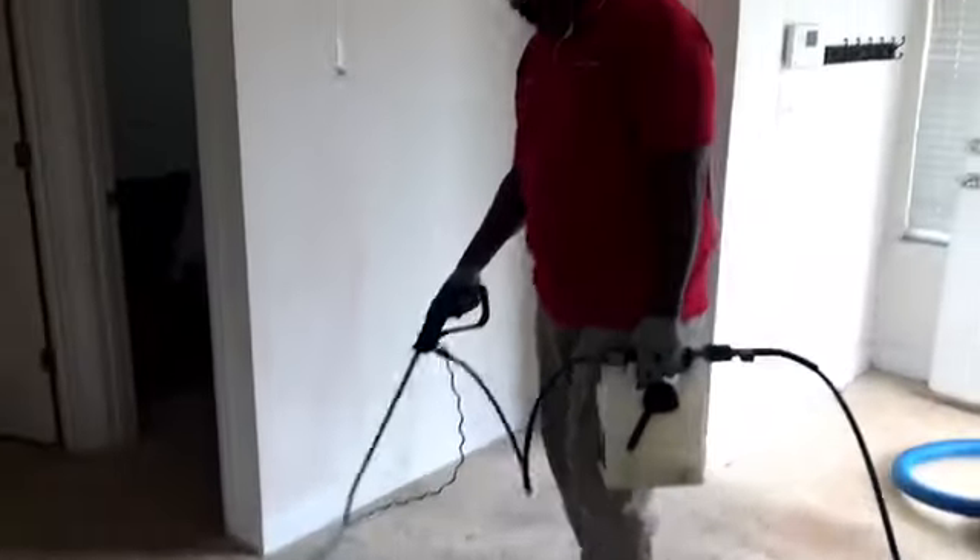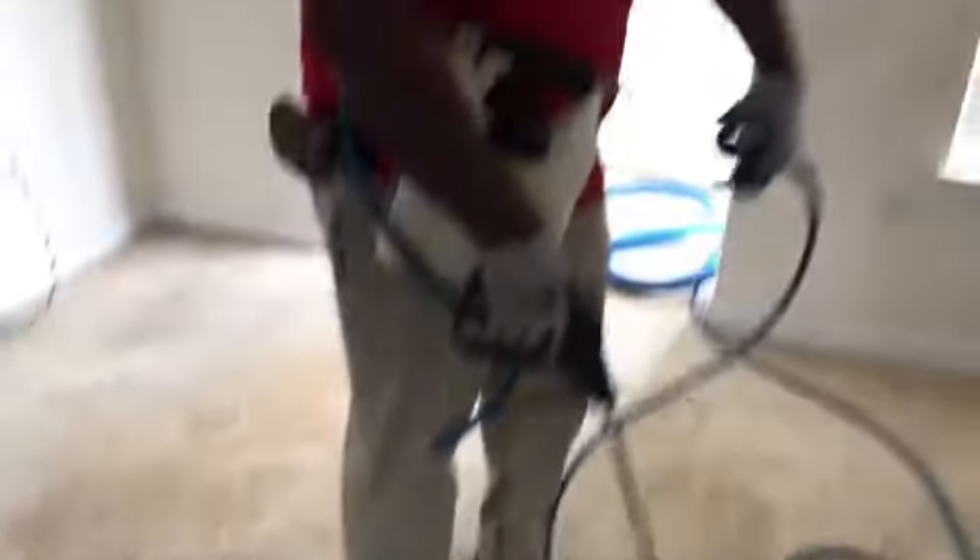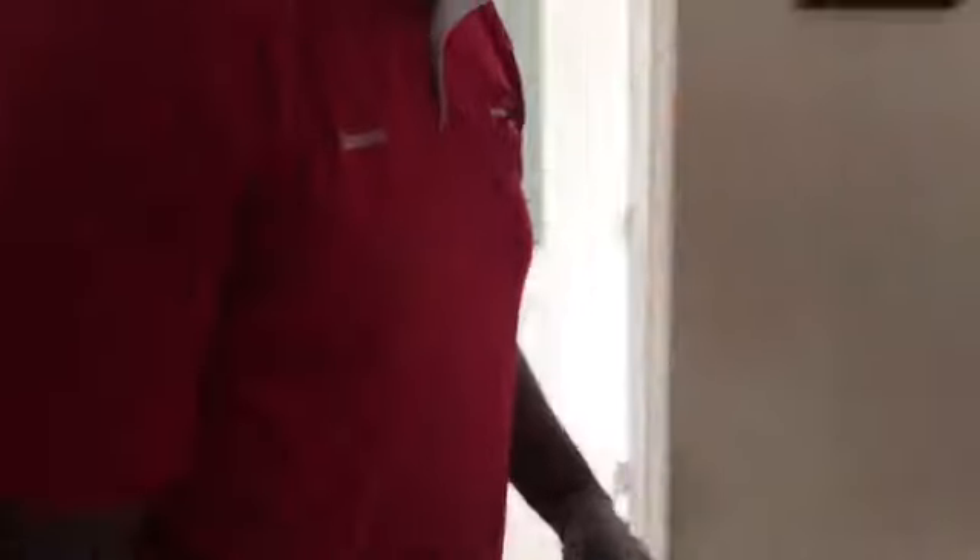So we're pre-spraying. I got a cocktail of different agents — I got enzymes, I got some stain buster, got a little O2 in here for brightening. We might have to do this one twice, but I think the scrub is going to give us almost what we want. We're going to do a brush scrub, come back with the metal wheels and extract it out, then come back with the wire, and we should have done great.